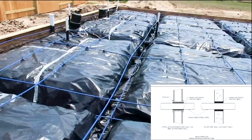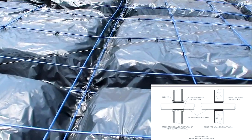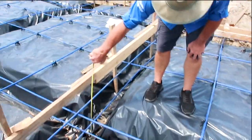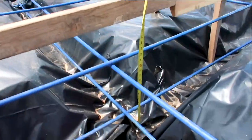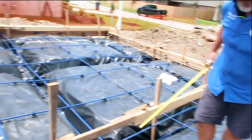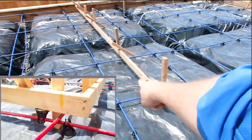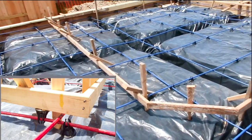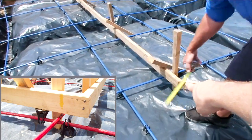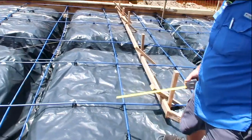Walking around, you can see the beams are clear of debris and all the post tension cables are raised off the foundation floor. Randy is measuring and showing that we're easily seven inches off the beam floor with the post tension cables. Also a pretty interesting fact — you need chairs underneath the wood for the garage slab. You can see that a chair is needed there in between the post tension cable and the garage frame.